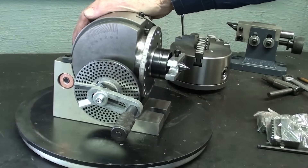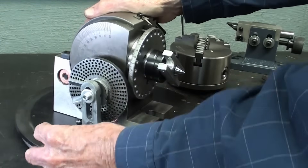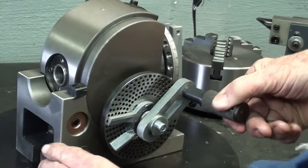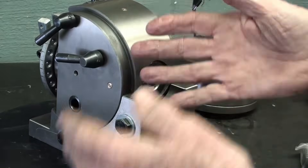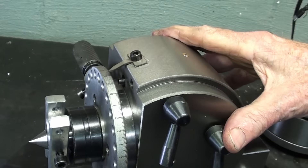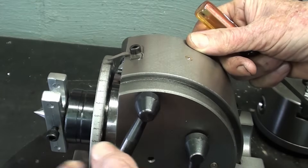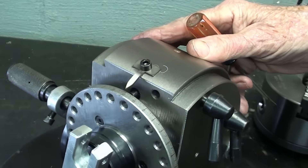When I say 40 to 1 ratio, that means 40 turns of the crank are needed to turn the chuck or workpiece one full turn. There are two little levers on this side — one is meant to lock it so you can no longer turn it. You get your setting, lock it before making your cut so it doesn't vibrate or move, then loosen it again before making your next adjustment. We can also do direct indexing with this head. There's a little pin here that this lever moves into any one of 24 holes for very easy direct indexing.